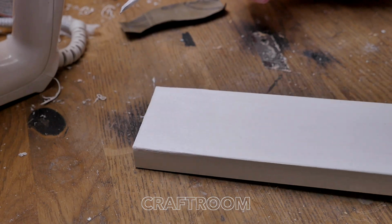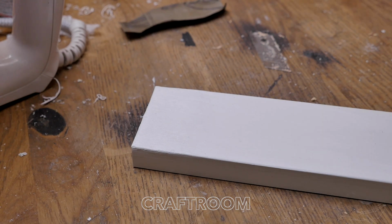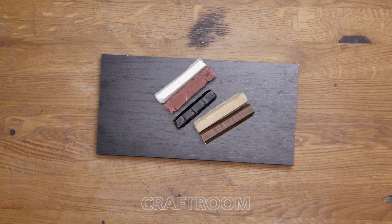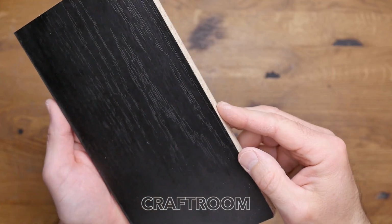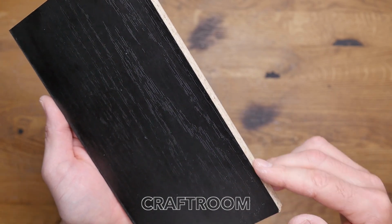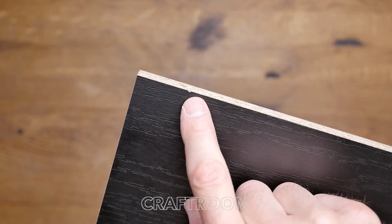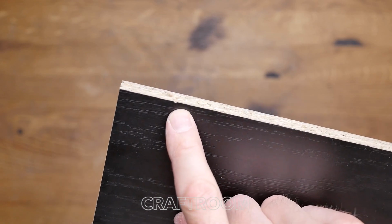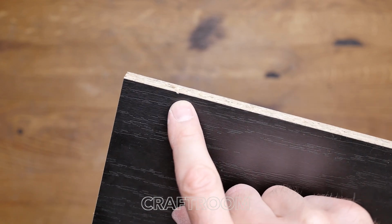Here is the finish. Now, as I promised, we consider the use of wax repair sticks for minor repairs to our furniture. Here is the factory end cut of furniture blanks. After cutting, it should be perfect, in theory. But somewhere, sometimes, a single chip will slip through. It's just for such chips that wax repair sticks are used.